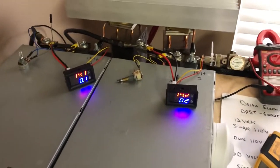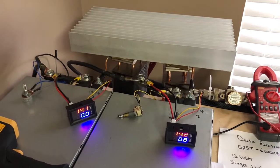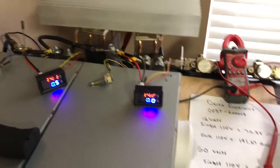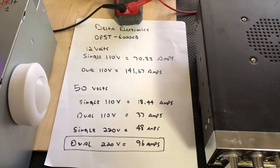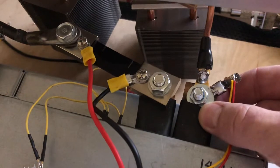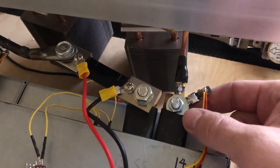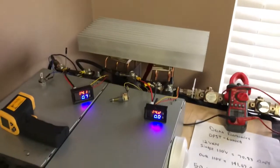There you go — this demonstrates RF man's load sharing network. I followed what he explained in his YouTube video and it works really well. Thank you RF man. These two power supplies are available if you want to pick some up — contact me and I can show you how to hook them up. I made a connector on the back using solid copper strips: I took copper pipe, cut it down the middle, split it, hammered it flat, and cleaned it up with a torch, allowing me to draw those high amps through the connectors. That's all — take care, 73s.